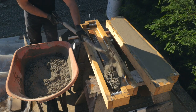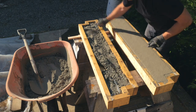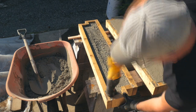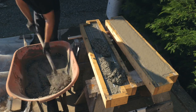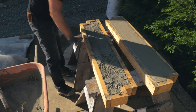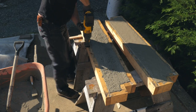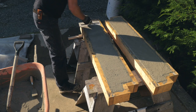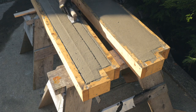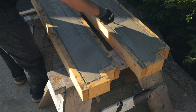The second batch went well. Like the first, I half fill the form, vibrate it to settle it and bring bubbles to the surface, add the wire grid, then top up, settle, and finish with a trowel. I'll round off the sides when it sets up. It was the end of the day so I covered the forms with plastic and left them to harden.